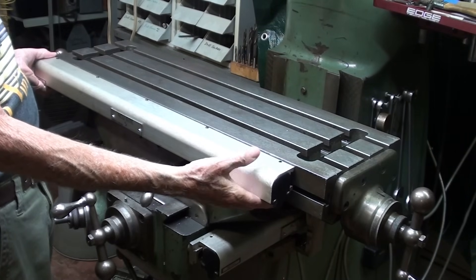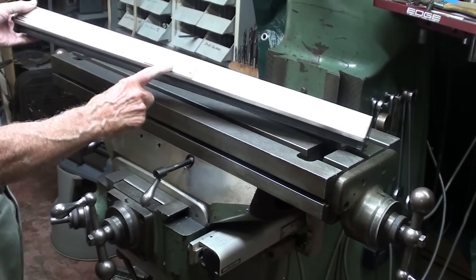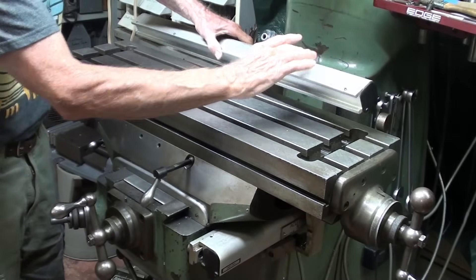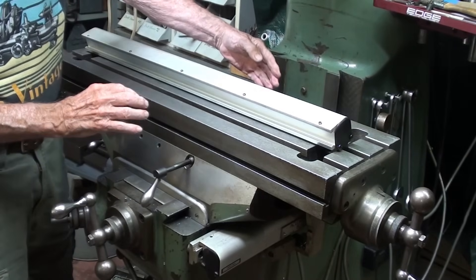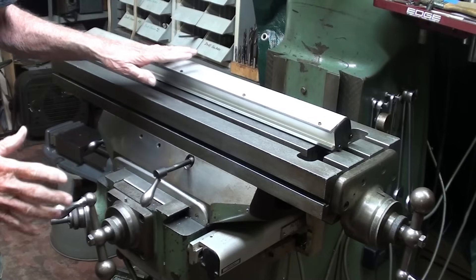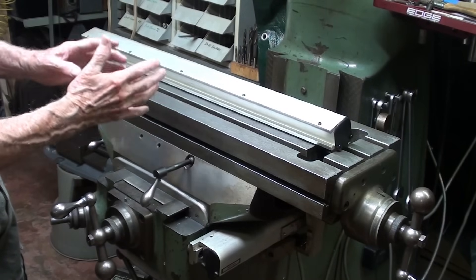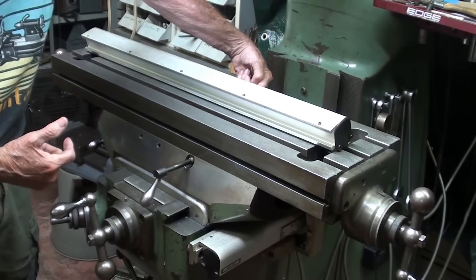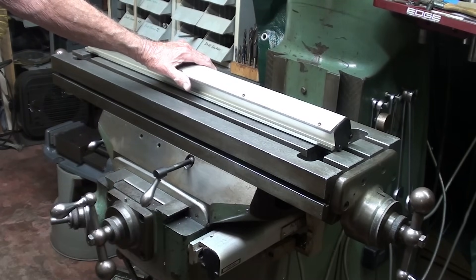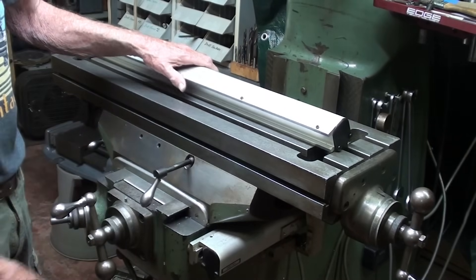Unfortunately, in order to install the limit switches for this device, I had to remove the X-axis scale for my digital readout. I'm very hesitant to remount it on the back side, because of the thickness there — I would lose about two and a half inches of travel before the scale would strike against the column. For the purpose of this video I took it off and will mount the limit switches in this T-slot right here, though I may not end up using them since I never leave a machine unattended while it's under power feed.